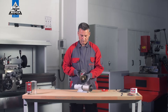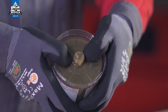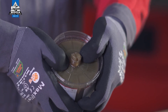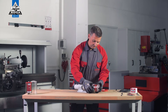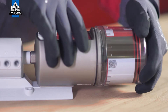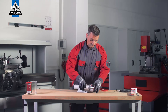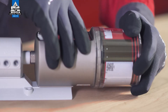Place the PRO-LC in the cover and remove the plug. Now press the PRO-LC into the cover until lubricant is expelled from the outlet opening. Place the PRO-LC with the cover on the PRO-C MP6 basic system. Make sure that the catch engages in place and the gear teeth on both components — the PERMA PRO-C MP6 basic system and PRO-LC — mesh.